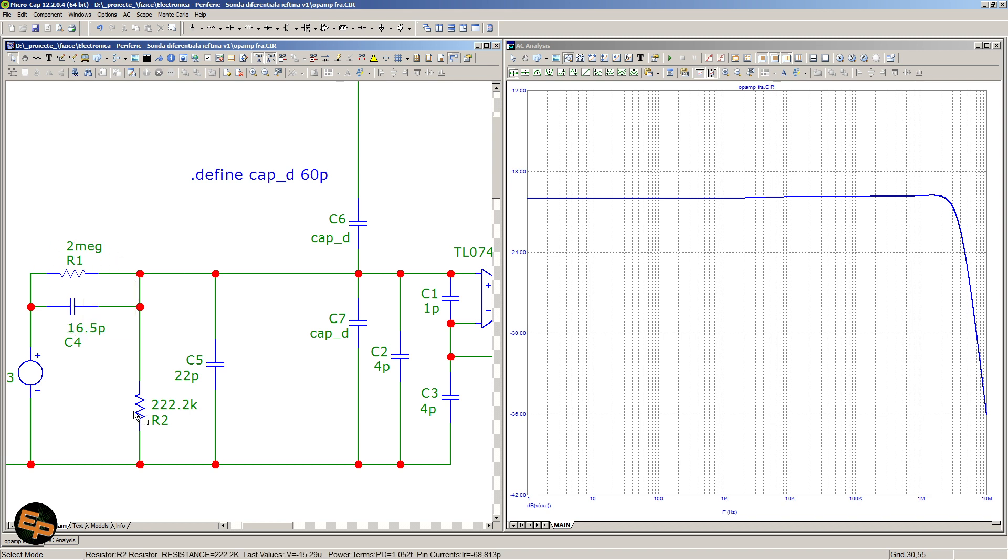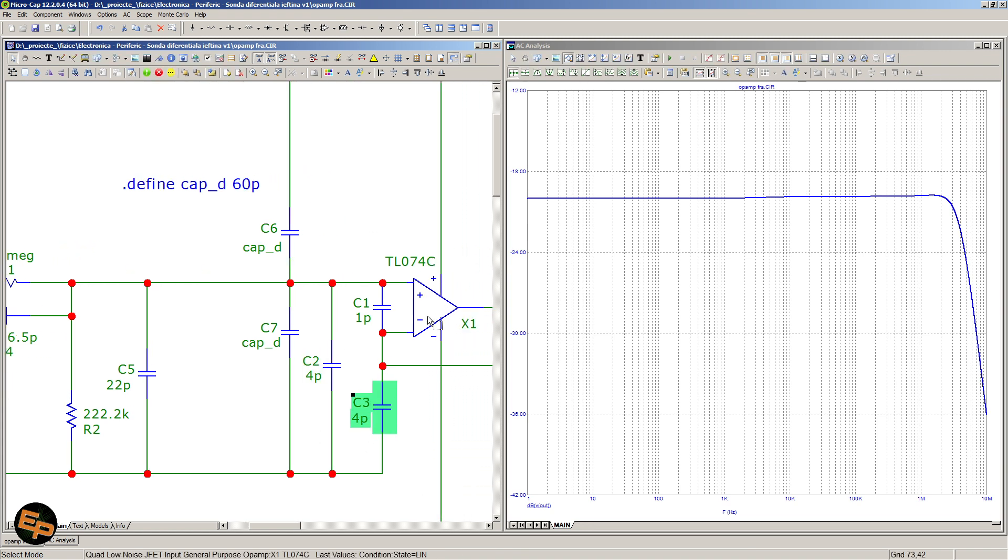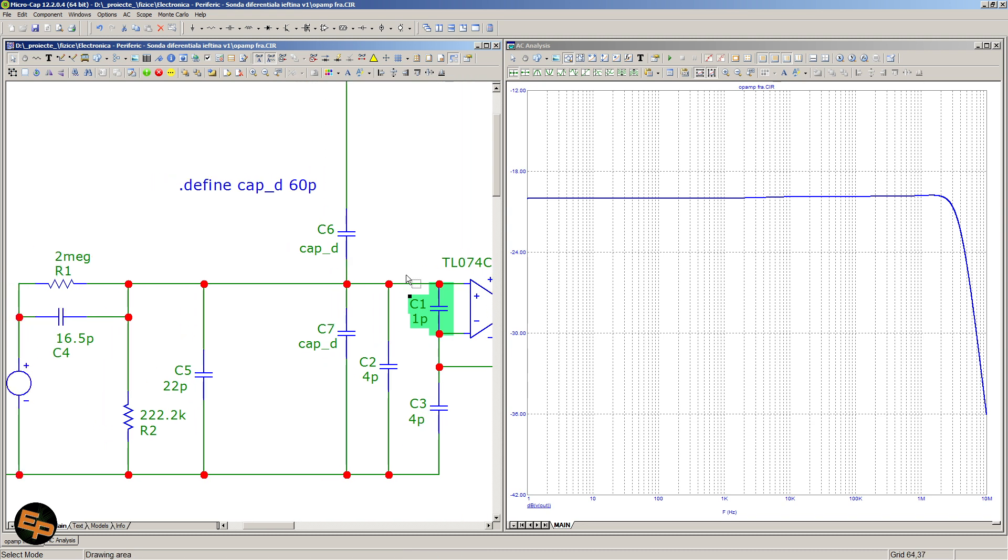This pretty much explains everything in terms of how I've designed this differential probe. The fact that I've used all of these components gives me a very cheap differential probe because the op-amps are cheap, the TLC 555 is not that expensive, all the transistors are cheap, the diodes are cheap — everything is cheap. This is how we can get a differential probe that goes up to 1 megahertz, which is good enough for DC, for AC power supplies, for audio frequency circuits, and for switch mode power supplies. The vast majority of switch mode power supplies work with around 100 kHz switching frequencies, so being able to go up to 10 times that frequency is good enough.